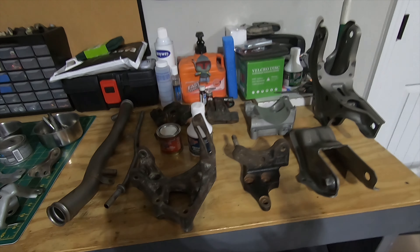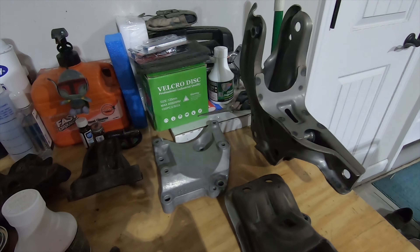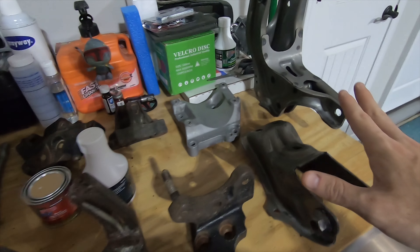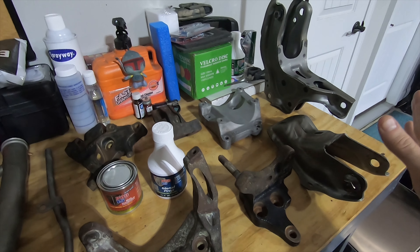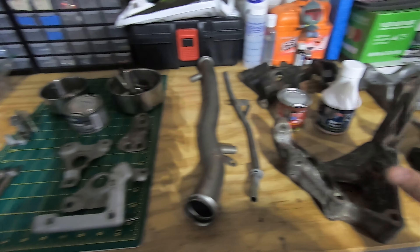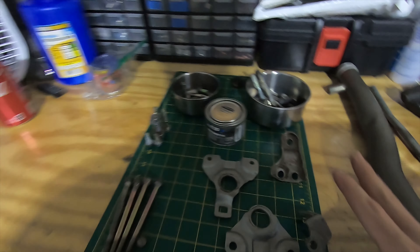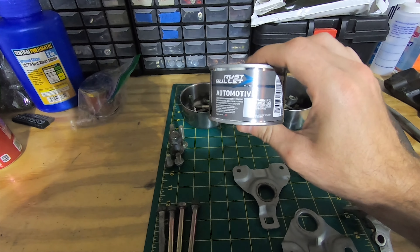This huge batch of parts is done. An issue I did encounter while degreasing was that the paint was coming off a good portion of these pre-painted items. So I went ahead and hit them with an environmentally-friendly citrus-based paint stripper in an aerosol can. After three coats, wiping down in between each coat, the pieces came out to where they are now. I did all that off-camera because it was tedious, and that paint stripper is really bad for your skin — I didn't want to touch the camera while dealing with it.